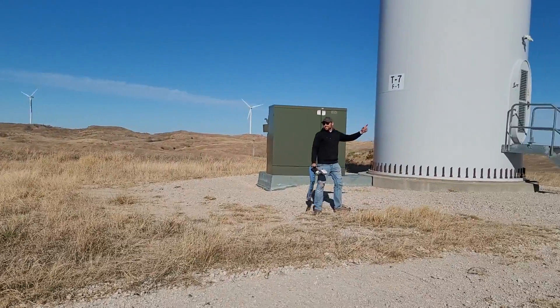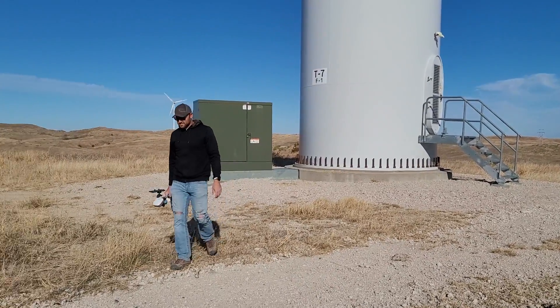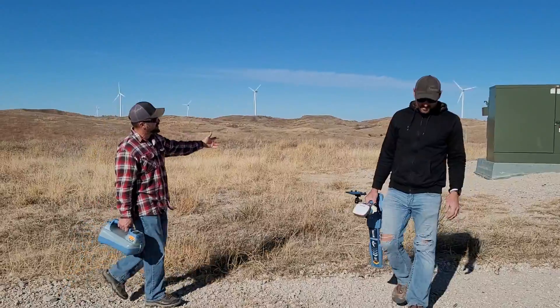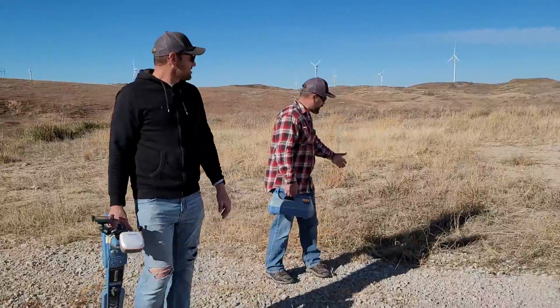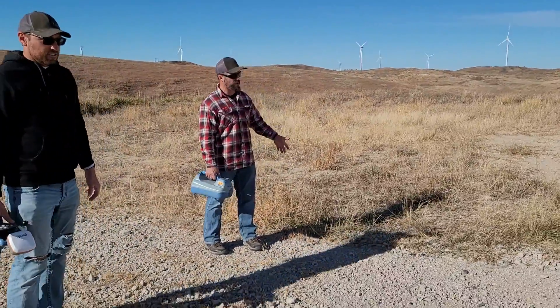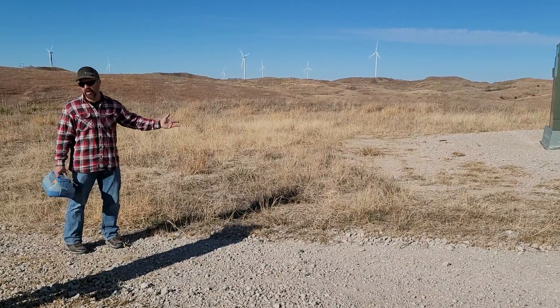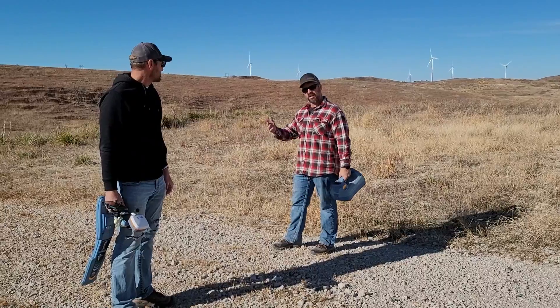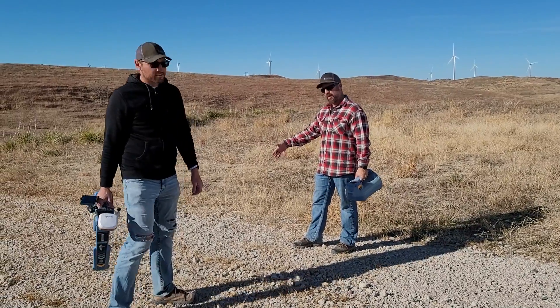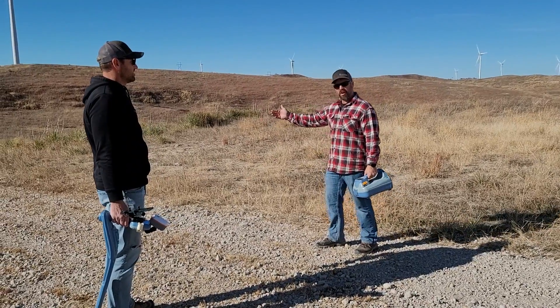It's all grounded. You've got a big grounding grid all the way around, so if you try to hook up directly you're going to end up igniting the grounding grid. It's going to mess up your magnetic field, plus you really don't have any idea which way the cable's going, so you don't know where to ground with a direct connect. And if you did get directly connected, using a low frequency is going to get interference from the high kV, and using a higher frequency is only going to work so far.